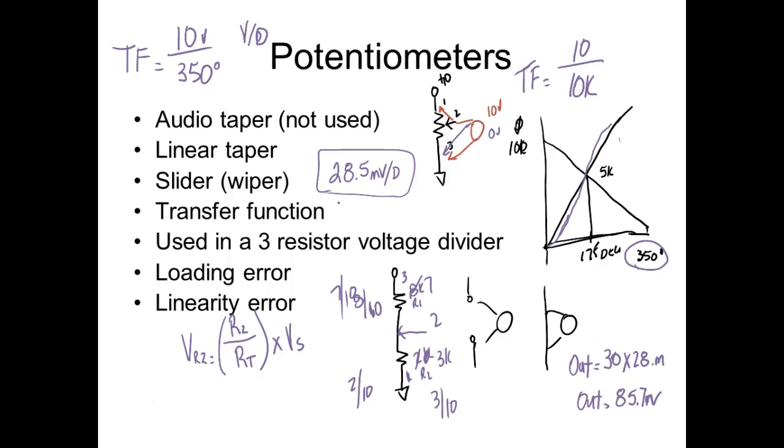If I'm going to calibrate that thing, I'm going to put a precise voltage into it, measure it with a standard, and then calibrate it to say 5 volts. But the problem is your meter still is not perfectly linear. So just about anything that we have is not perfect. Potentiometers are not perfect. One of the specifications, if you got the true specifications on the pot, is something called a linearity error. This is the maximum it should vary over an entire range. You just know that would basically be your percent error.